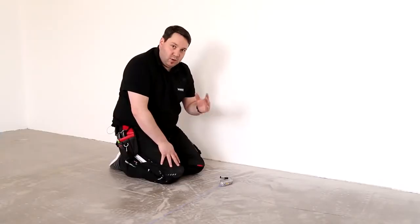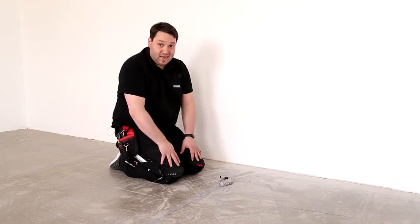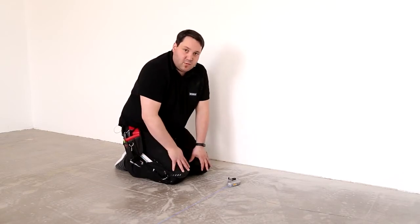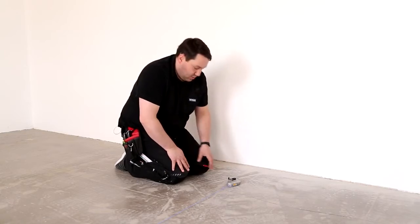You need to apply glue to the floor surface prior to laying the flooring. We recommend a layer of at least 2 mm evenly applied with a squeegee. Experience has shown that it is worth marking the angles in a room before starting to lay the floor, as not all walls are 100% straight. We are going to mark a chalk line in the middle of the room to ensure the best possible layout.